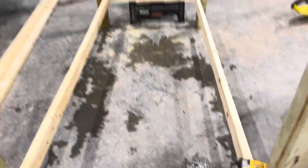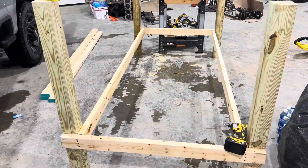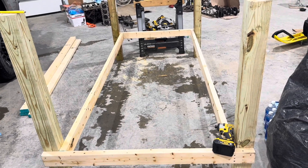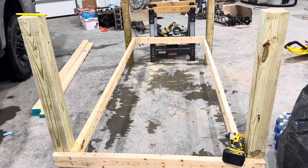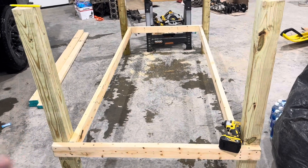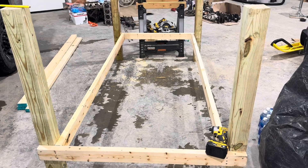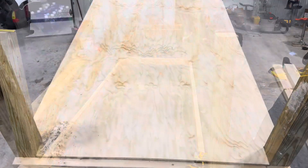I like to have the 4x8 plywood sitting down on the long edge of the frame. The way I build these, the structure is kind of like its own aesthetic — like a unibody car where the workbench's appearance is its structure. I wanted to show it assembled before cutting because pieces on the floor are hard to follow. Now we're going to go notch the 4x4s and get them in, because I want to stop looking at them in the back of my truck.